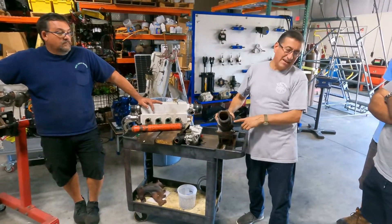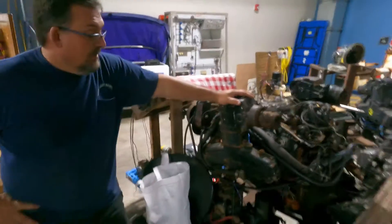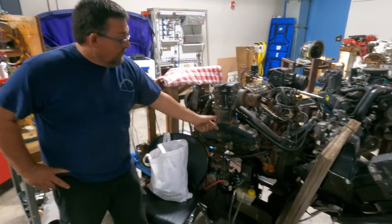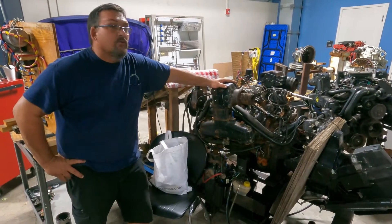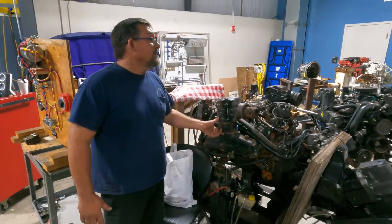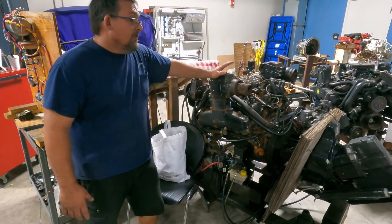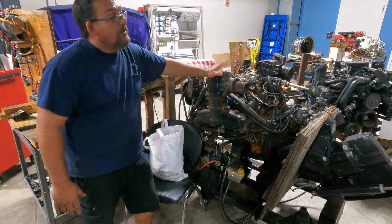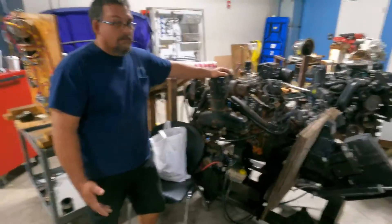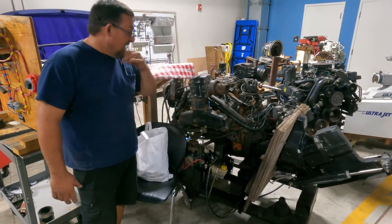This engine has a riser extension on the exhaust. Why? Because the motor and exhaust are below the water line — without it, water would be ingested into the engine. They come in three-inch and up to six-inch extensions depending on the boat. These exhaust manifolds last only about three to five years. The more you use it, the longer it lasts; the less you use it, the shorter the lifespan — because it sits and corrodes. Water turns acidic over time, and this cast iron will swell up and the walls will be eaten away. This engine here was locked up because of water entering through the exhaust.